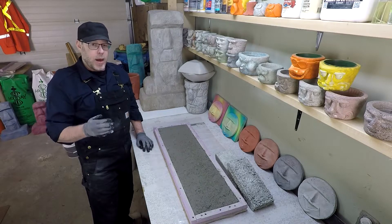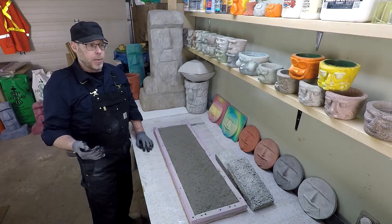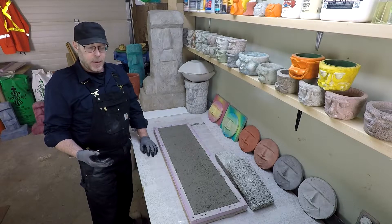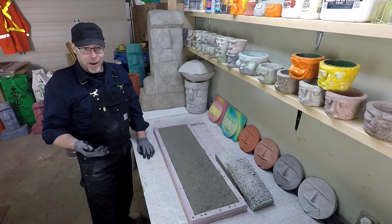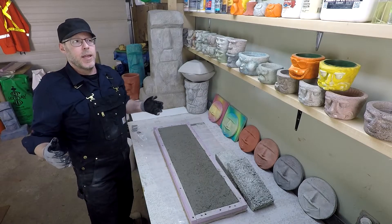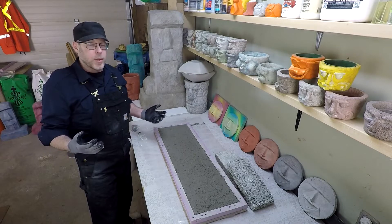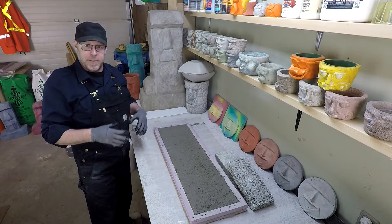If you want to avoid delaminating, cracking, or early failure, I would do all of these steps cumulatively: prepare the surface properly, ensure SSD conditions, and use some means to bond the concrete together — whether mechanically or with an admixture or bonding agent. Doing all of these things together gives you a much higher likelihood of success. One more important tip: consider the substrate — the concrete you're attaching to. Is it in good condition? Is it mechanically sound? If you take a screwdriver and scrape at it and nothing happens, that's exactly what should happen with sound concrete.